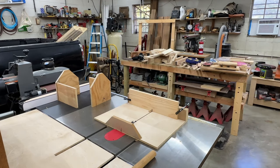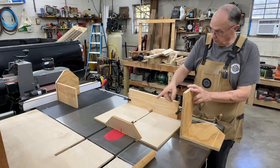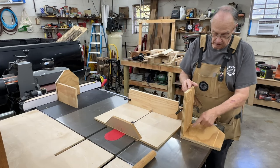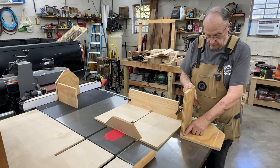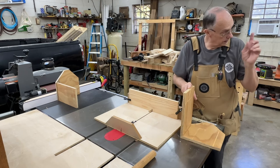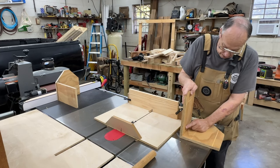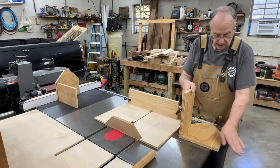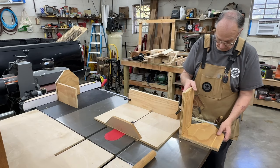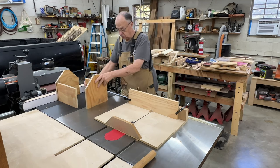And then before I glue it up, what we'll wind up doing, I'll get me some 1/2-inch. And what I'll wind up doing then, with that 1/4-inch dado blade, I'll run me a dado all the way around it. I may do it on the router table, because what happens, see, this wouldn't be a problem, but they'll run outside, but if I did it on the router table, I could set it down and not have it run all the way through like on a table saw. I'll show it to you when we get there, but I always like the looks of box joints.